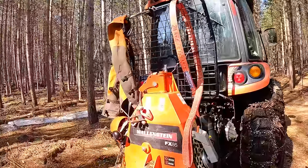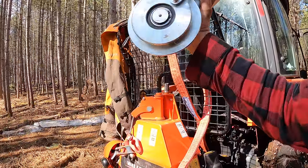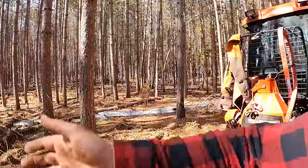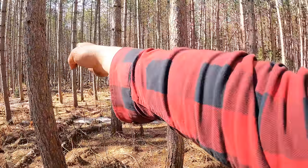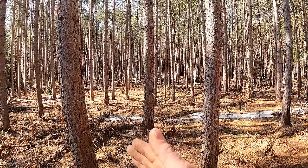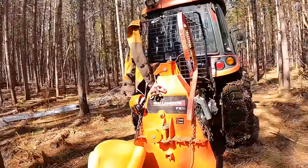On the topic of skidding winches, one thing I'd strongly suggest you get is a directional pulley — you're certainly going to need one to change the direction of the pull. If I don't have a clear shot with the cable in a straight line to that tree, I'll need a pulley to redirect the cable, and that's where it comes in handy.